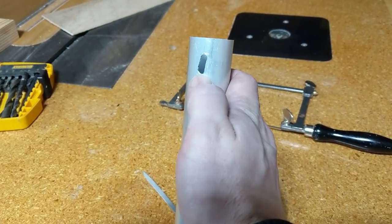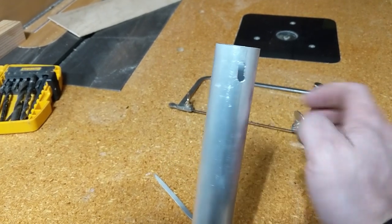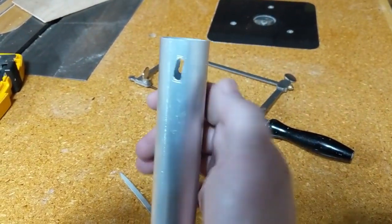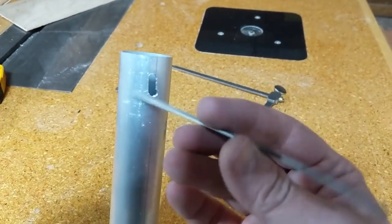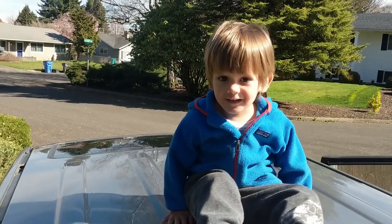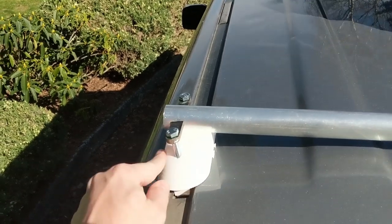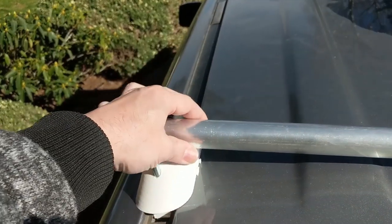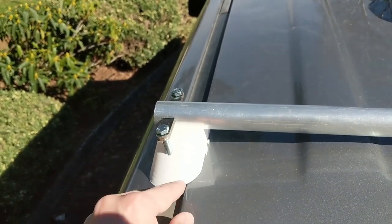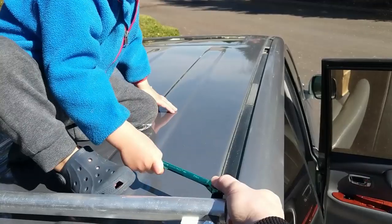You can see the scribe marks around the hole. I've drilled out two holes at the top and the bottom, then used a coping saw — a jeweler's saw — to cut between the holes. Now I'm just using this needle file to file it down to the final shape, which is slow going. But it's working just fine. The mounting surfaces and the surfaces that engage with the roof are all working quite well — basically finalized geometry.